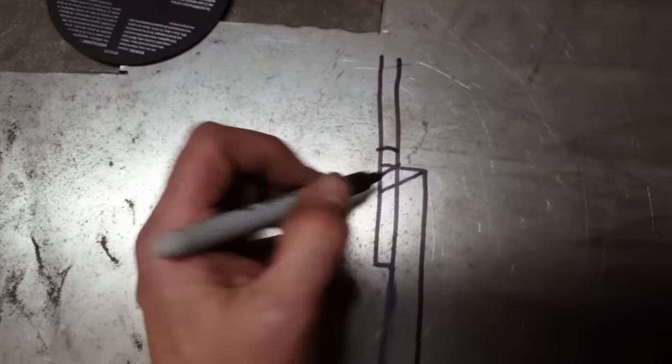So I find it a lot faster and quicker, and you can control it by having the piece behind it, because trying to fit this large opening by cutting it all out and then trying to butt weld it in, the chances of it wanting to move around on you is greater. At least when you're cutting it across and you've got something behind this, this is not going to move, right? And then as you're moving around, you weld it as you're going, and what's behind it won't move. Bloody old compressor kicked in. But anyway, I'm going to go ahead and weld all this up.